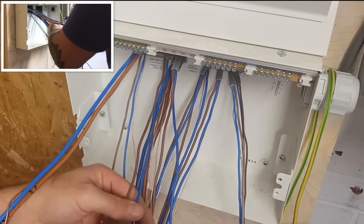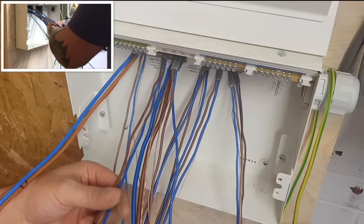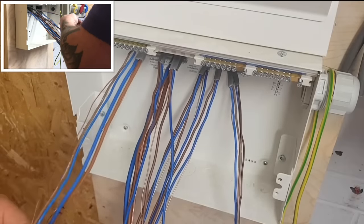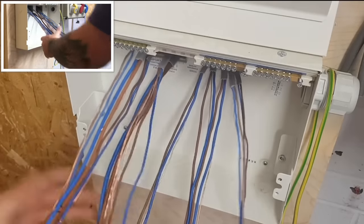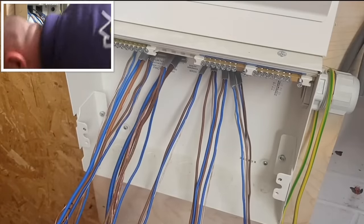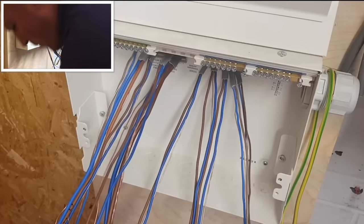And then finally, this will be the very last one. I've already labelled them. I'll stick them together. So it was a mess, and now it's tidied itself back up again. Oh, hang on a sec, I've got a straggler. And I don't know what I'm going to do with him, because I've used up all my breakers. I suppose I'll put both the radials together in a 20. And the radial circuit is circuit 8. 1, 2, 3, 4, 5.